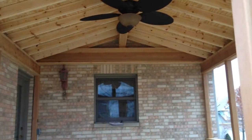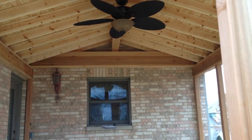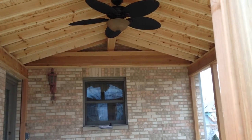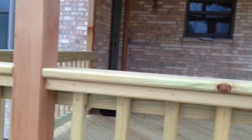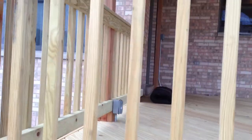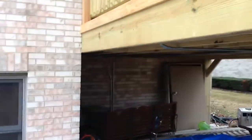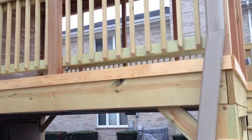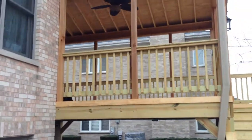As you can see, our rooms are all self-supported. Back there, that's what's called a king truss. It's trimmed out in cedar. The reason that we do that is so that we don't have to rely on any of the framing inside of the wall — this is a self-supported room. It's just a much better, much sturdier way of building. So this is the open porch from a larger view here.